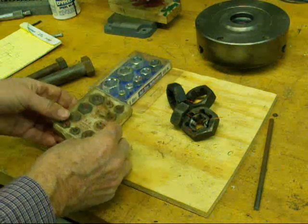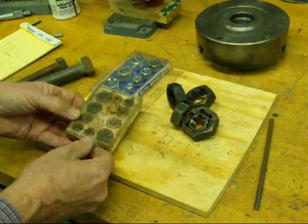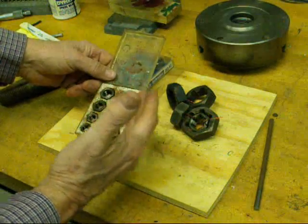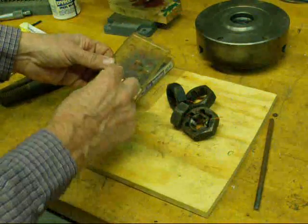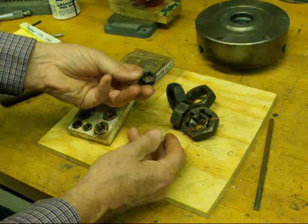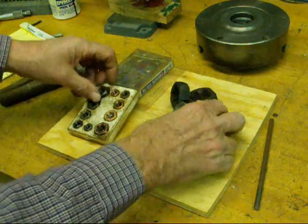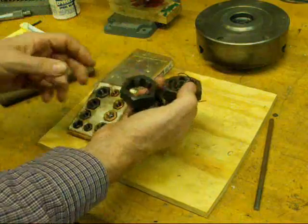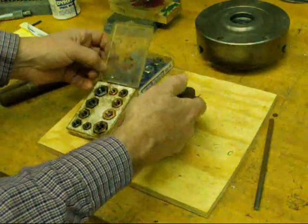If you're a mechanic, you're probably going to use these re-threading dies. This is KD, called hex re-threading dies, and there's both coarse and fine in the set. You run those across the thread — if it's a stud on an engine block you'd use this under the hood of the car with a wrench, socket, or ratchet. These are only for cleaning up threads; they are not meant to cut new threads. They come in much larger sizes as well, and are available in metric.